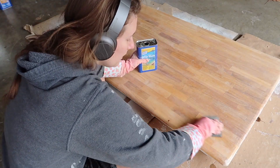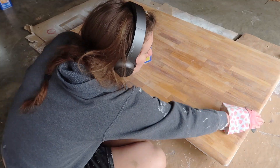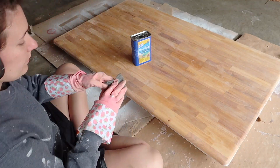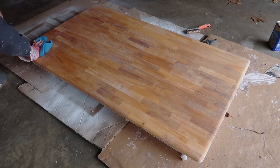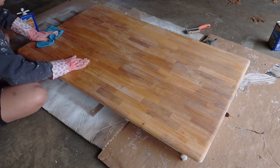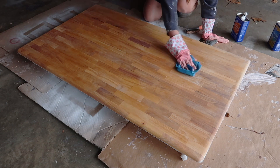The Citrus Strip is super sticky and super messy. I even felt like the after wash wasn't doing quite the job to get it off — I had to scrub super, super hard. After that, I went in with mineral spirits and just a microfiber cloth and tried to clean up any remaining residue. Then after the wood was dry, I moved on to sanding.